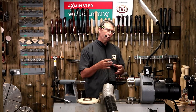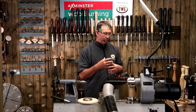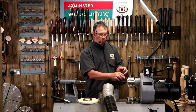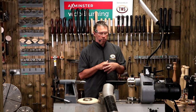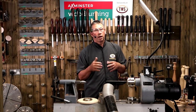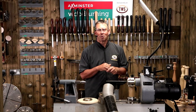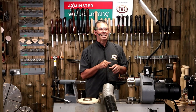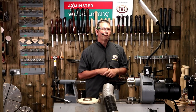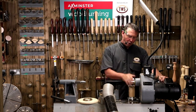I'm looking to go over a few of the jaws, a few of the centers, and some quirky little things you can do with this equipment. Just on an outline - all of the jaws and the chucks are stainless steel. So all of the chucks you're going to see me demonstrate today are stainless steel throughout. In terms of corrosion, it's really, really good at standing up to humidity and moisture. In my workshop in the UK, it's quite a damp place, and non-stainless chucks can develop rust if not used for great portions of time.